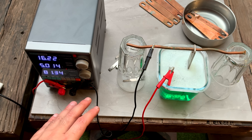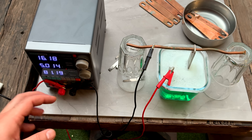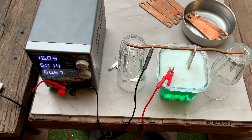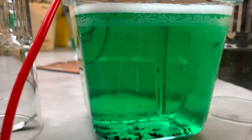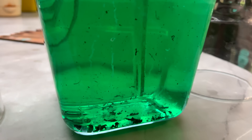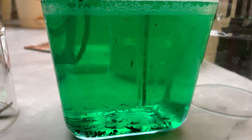I'm going to spend about three to four minutes on both sides to fully coat this in nickel. This process is working really well — I could get a taller container and dip the whole bus bar in, but this doesn't seem to take too much time. Some of what you see floating around is scum coming from the nickel strips. Even though they say they're 100% pure, we do get some black scum, but so far so good — it seems to be working well.